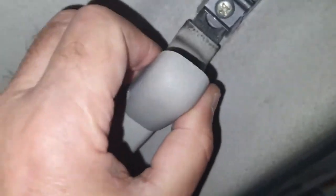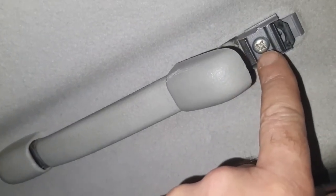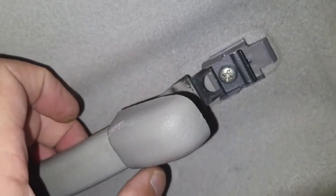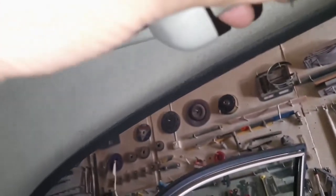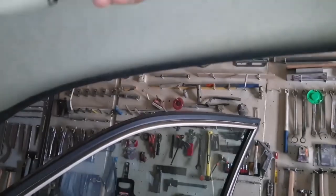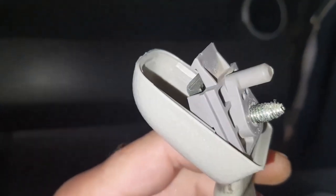Starting with what's visible — we unscrew and remove. Here are the two small screws from the trim. Next we pry here and smoothly slide this part. We see another screw — pry and slide it over. The manufacturer was smart: the screw doesn't fall out, it stays in the joint. The handle is removed — right away I take a piece of masking tape, write on it, so it's clear how the handle should sit.